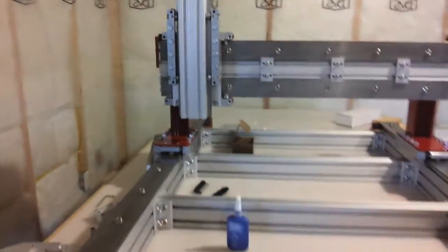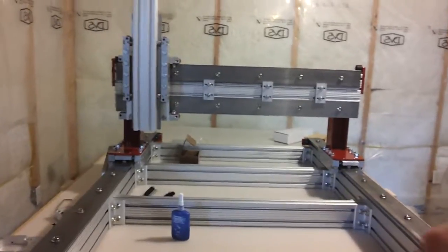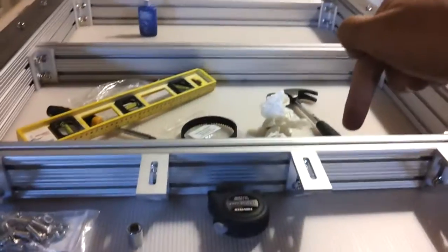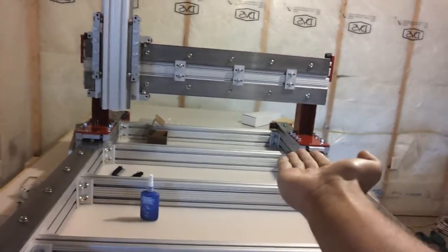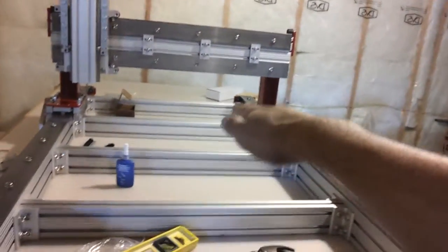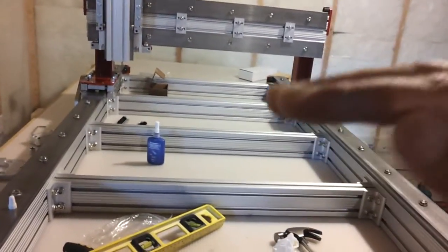If I were to use flood cooling, my idea was to raise the back. The back of this machine, I'm assuming, is this side, and this is my front, where these guys are. If I were to raise my back up and tilt it forward, no sorry, backwards, scratch that. The machine will be sitting up because of the problem I've hit, so I would have the back of my machine tilted back just a little bit, so that the water is flowing backwards.